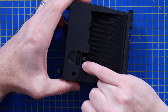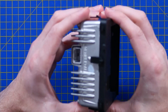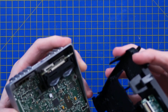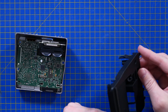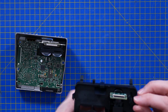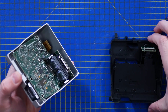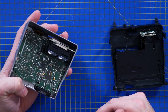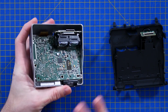This bit here looks like it's potted in over this camera. That camera is lifting up with it, whereas what looked like the stereoscopic lenses are staying behind. There's a ribbon connector - never getting that back in. The camera was on a ribbon connector. This is a problem you might have in hot climates: if this is in your windscreen and is black plastic, it's going to get very hot very quickly. It has a heatsink on the back to dissipate heat, and everything is thermally bonded down, which shouldn't come as a surprise.